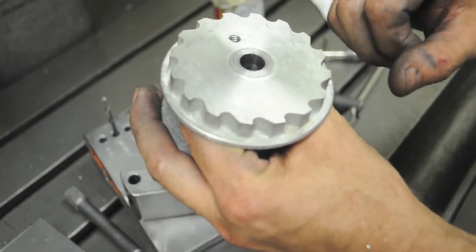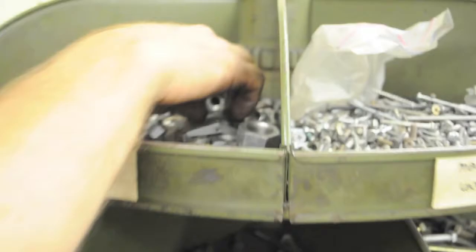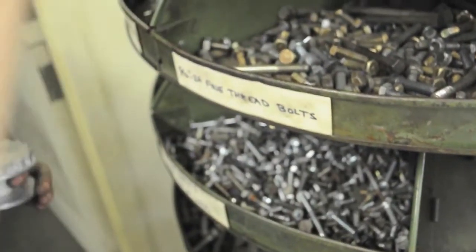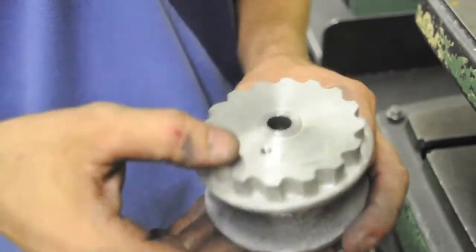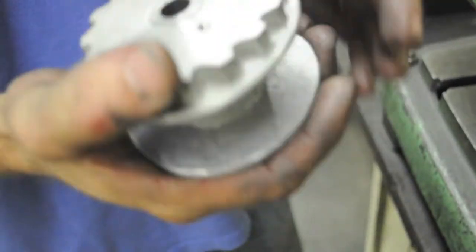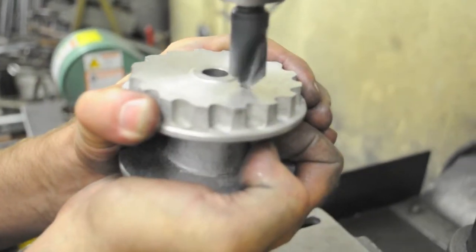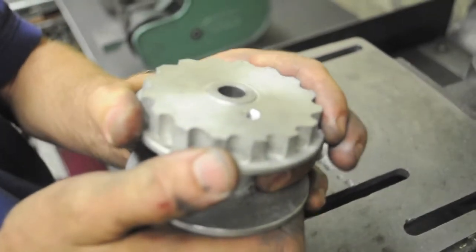There will be a pretty good sized burr around the mouth of the hole — we want to get rid of that. If you look at a nut, there's a big chamfer at the mouth of the hole that makes it easier to start the bolt. So we'll come over to the countersink. The directions tell you to do a five-sixteenths diameter countersink; the outside diameter of the hole is a quarter inch (0.25). Don't worry that the hole is at an angle — just pretend it's normal to the surface. Push hard for a couple seconds to get a nice sized countersink, bigger than a typical edge break.